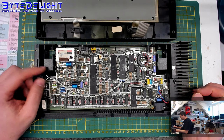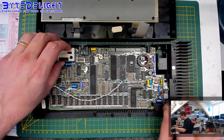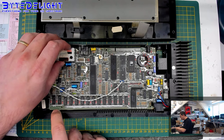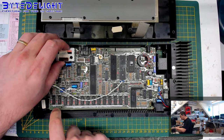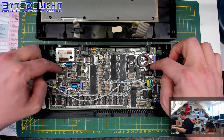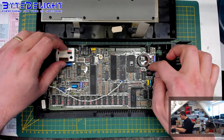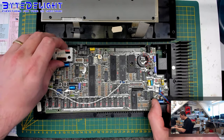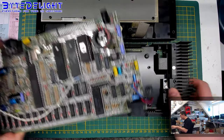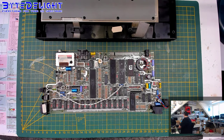All right, so the first thing we're going to do is to disconnect the board. And this one seems to be screwed detached already. Normally there are two screws on the bottom, not here. These are for other purposes, for example, for mounting the Interface 1 or the Disciple Disk Interface. Do not screw screws in here from the top. Those are not meant for that. So we will get it out and carefully place the case somewhere else so we won't damage it.